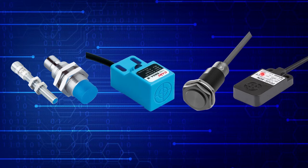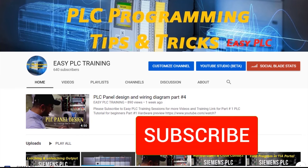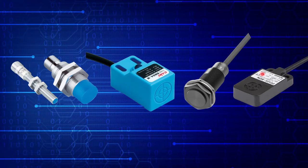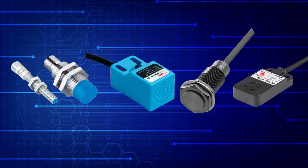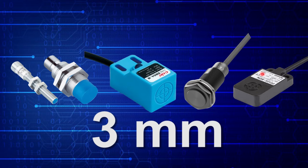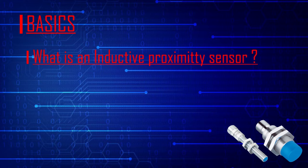In this video, we will cover how an inductive proximity sensor works and how to select one for your application. Manufacturers offer AC, DC and analog output sensors with industrial washdown and harsh environment ratings. Sensors usually come in round, square, and rectangular bodies, with sizes ranging from 3 mm to 30 mm in round sensors. Let's start with the basics.